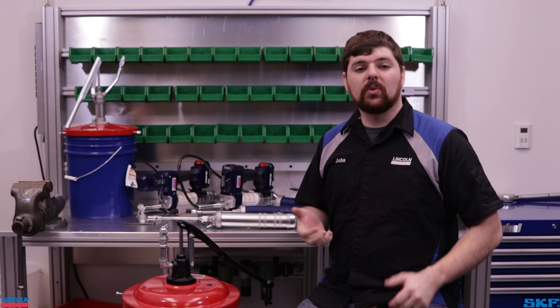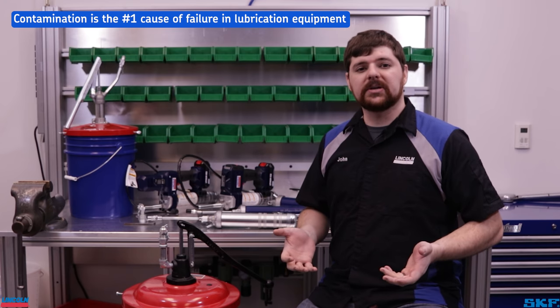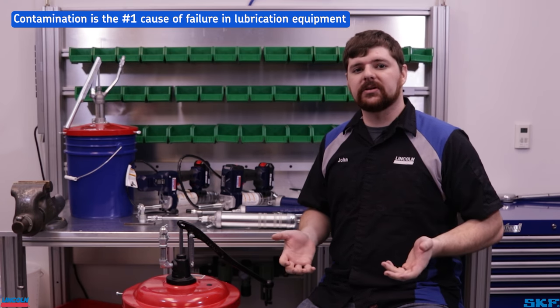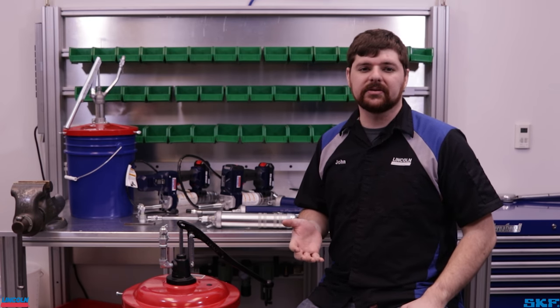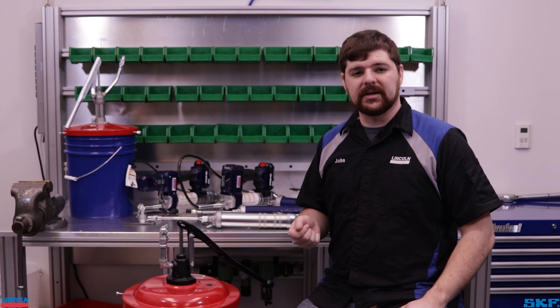While a valid method to fill the tube, one major issue to be aware of with this procedure is contamination. The bulk container must be open for this process, which may lead to dirt and foreign material entering the containers. I do not normally recommend filling this way unless as a last resort. Additionally, many locations have policies prohibiting open containers.